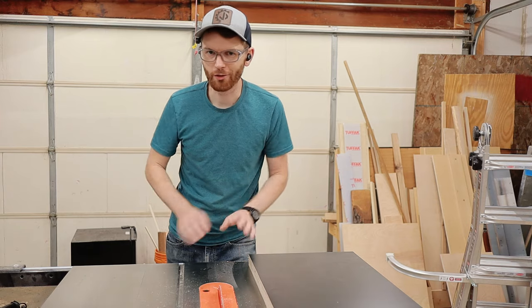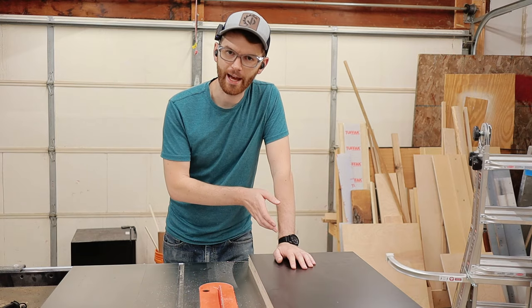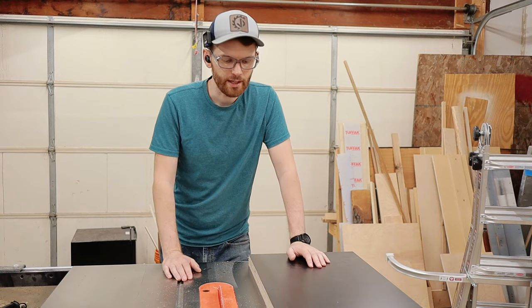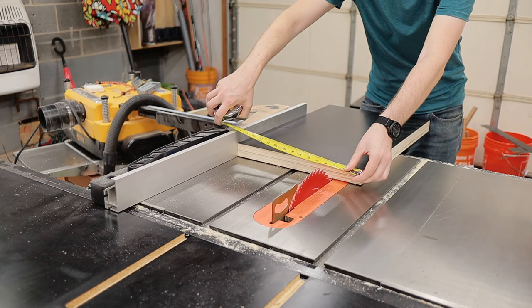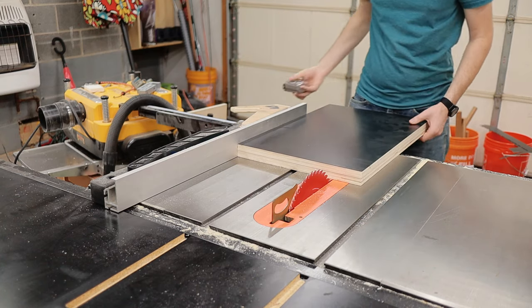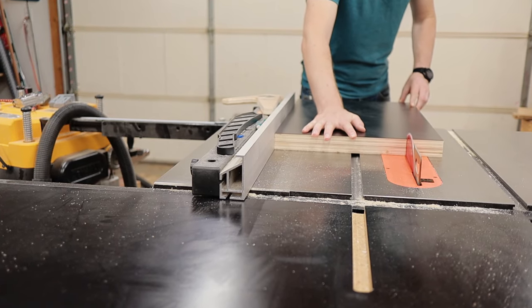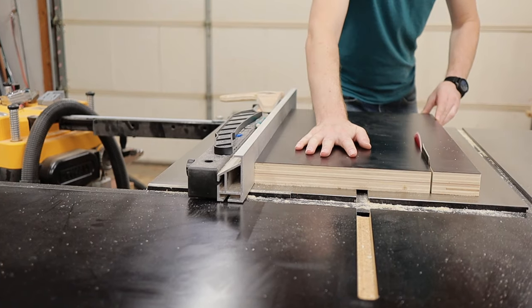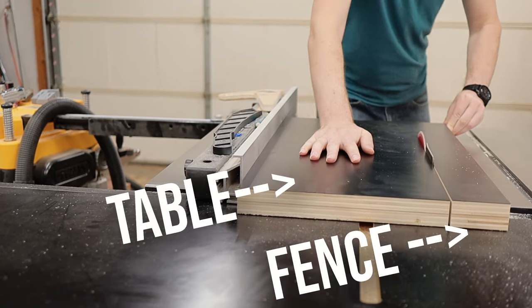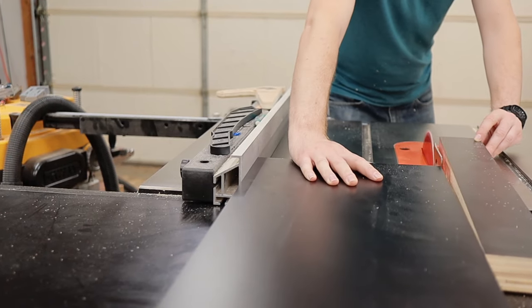I brought the whole panel back over to the table saw. It's a little scary, but I'm about to cut it in half. What I really like about this method is now I know that the face of the fence and the top of the table are going to be perfectly flat and straight. And ripping them on my table saw, which I've already checked with a 90 degree angle finder, I know that the bottom of the fence is going to be perfectly square. After I get this thing cut, then I'll start working on the dados for the T-track.